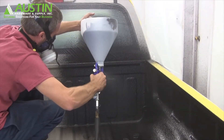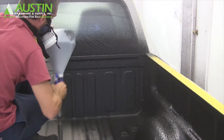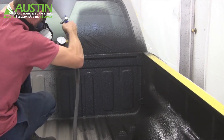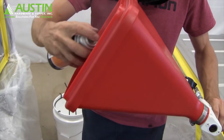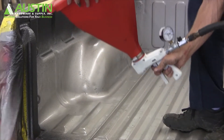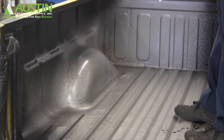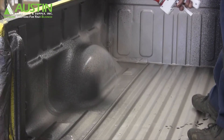Keep in mind you're going to see two guns in this clip — one being the low volume 1.25 gallon gun, the second being the large volume 2.5 gallon gun. Here we've gone to the large 2.5 gallon hopper. Volume is considerably faster, so for applicators not comfortable with fast volume, consider the low volume gun. For guys that are versed, this will reduce your spray time 10 to 15 minutes.